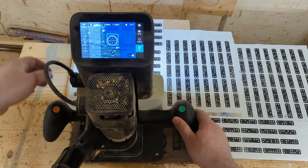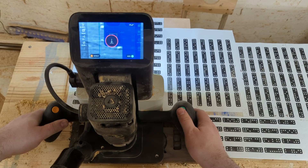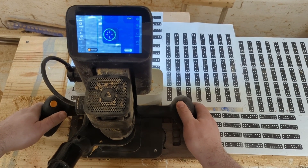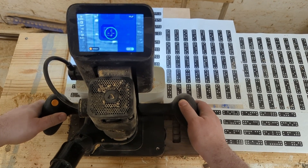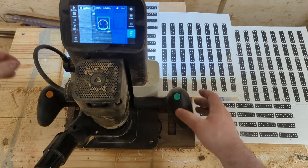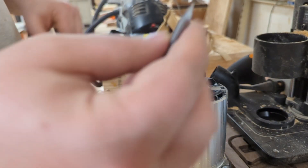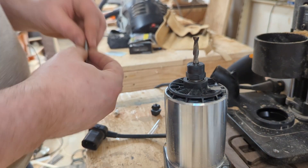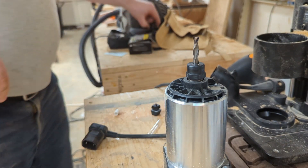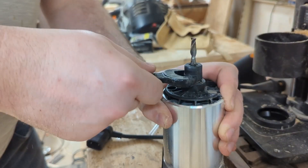I do this for each of the individual key pieces, then switch over to a different style of cutting — just a plunge cut and kind of scribble around for the little hole. Everywhere that's blue is a place I've already cut, so it keeps track of what I've already done. Now to add a chamfer to clean up the edge, I'm going to use this engraving bit. It's not the right bit, but I'll tell it to trace exactly on the line and plunge just a little bit into the work piece, and that'll give me a nice 45-degree chamfer on all the edges.